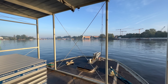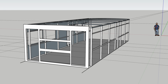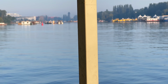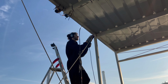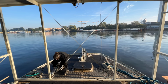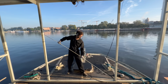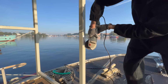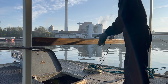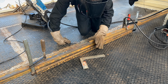Upon receiving the wall panels, it became apparent that the initial layout was not compatible with the new design for the face of the structure. To provide sufficient strength for the three horizontal windows, I needed to add horizontal beams between the two doors. This required removing the bracing, stripping the paint, and preparing the steel for welding. The bottom beam was made from a thicker steel square tube. And I had to weld together a thinner steel tube for the upper beam.